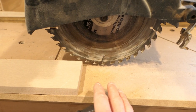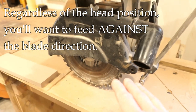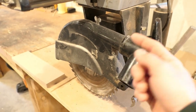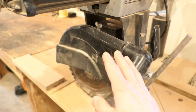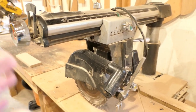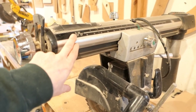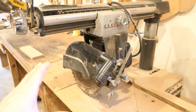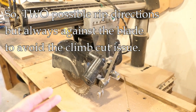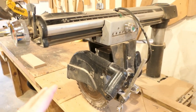If you fed it from the opposite side you'd be going against that action and it would be more stable. There is an in-feed and an out-feed direction, and most radial arm saws — the head can turn either direction. So for the people who made comments that there's only one direction to rip, you're flat out wrong. Right on the scale, and as shown in the manuals, these were sold and described as ripping in either direction.